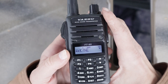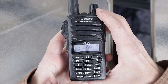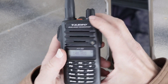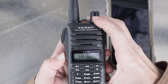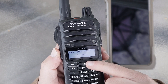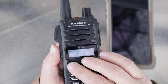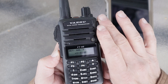Hold down VM, long hold, and memory — it gives you that beep. That's the long way of doing it. Now let's look at the shortcut method. I'm in memory mode, so let's get back to VFO mode. Let's work on the 70 centimeter side. Before we do that, let's use the shortcut keys from the first video. Short press of the function key and P3 — that sets mode T squelch, your tones, T squelch, and reverse. That's hard-programmed into this radio and you can't change it.